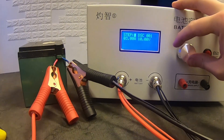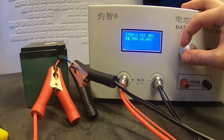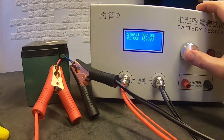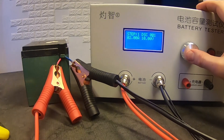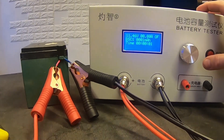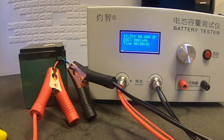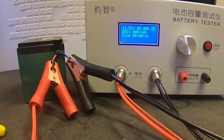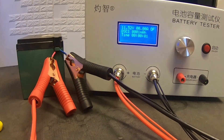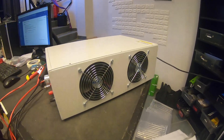We're gonna modify step 1. Even if it went down to 9 volts it would stop. Let's try 2 amps. Going back, holding it in — on 2 amps it immediately drops below 10. I think I will have a pretty nice time testing batteries on this battery capacity tester. But why doesn't the fan turn off when you're not using it? Maybe it has a cooling down period. I'll just leave it on for a while. We lost fan spin after about 30 seconds to 1 minute, so the fans will turn off.